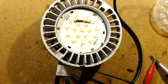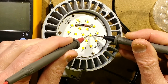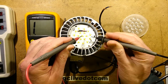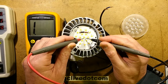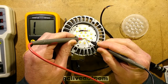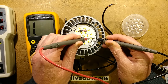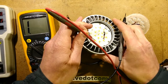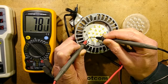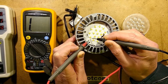Are there any others that I can actually test? I'll bring this meter in and probe them. The fact that so many were out suggests they've failed in a short circuit manner. I wonder if that's a deliberate arrangement they've got inside. That is a dead short circuit. So this LED is just absolutely dead short. These are all failed dead short — even the one that's slightly grilled. This one is not failed dead short, that may be one of the working ones. I wonder if that is a deliberate system whereby if one LED fails... this one has a diode. It looks as though it's got a standard diode configured in the reverse polarity to the LED chips.